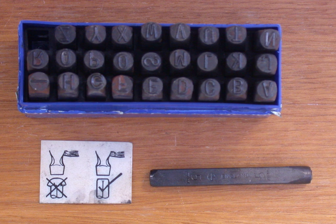If the end of a roll pin punch is damaged or deformed, it should be discarded. It is virtually impossible to re-grind the tip of the roll pin punch and properly shape the center projection. When using a roll pin punch, make sure the axis of the shank is in line with the axis of the roll pin. Do not cant the roll pin punch off to one side. When you strike the roll pin punch, hit it directly on the top of its head. If you strike the head at an angle, you may bend the shank.